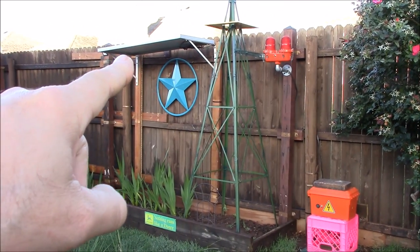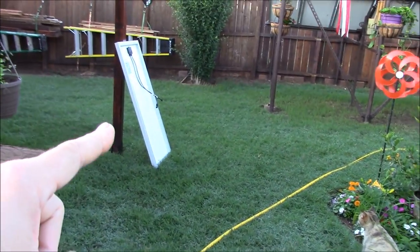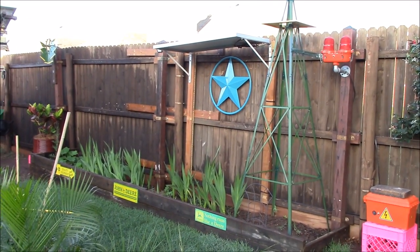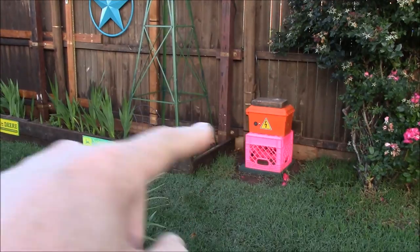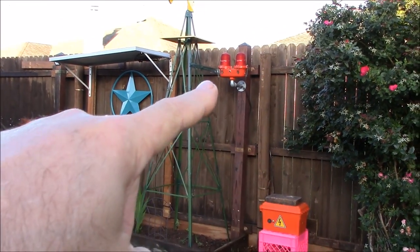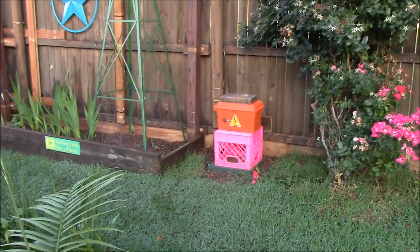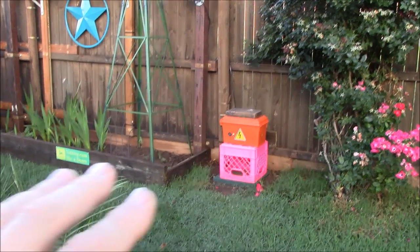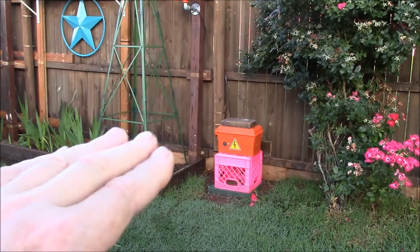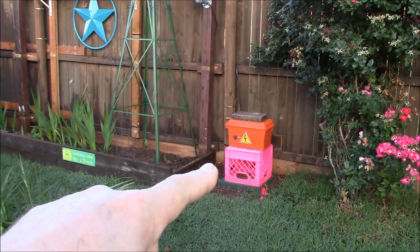This little micro solar generator system — I absolutely love it. It's got a 100-watt solar panel, and I'm going to be putting another 100-watt panel on brackets right up here, probably today, so I'll have 200 watts going into this box. That runs my lights and the solar pond pump. Right now I'm not making enough voltage — the cutoff is at 12 volts on the load, so if the batteries get down to 12 volts — about 50% state of charge — it shuts the system down.